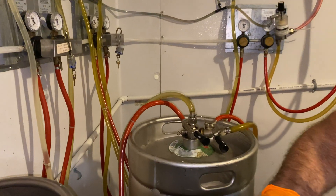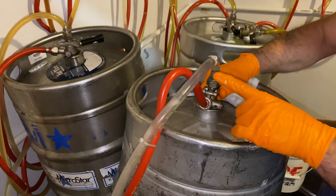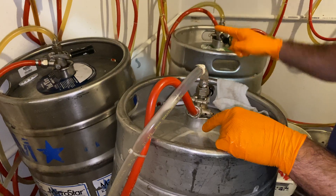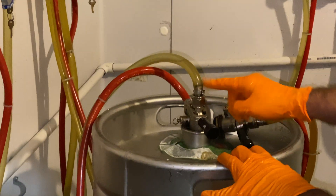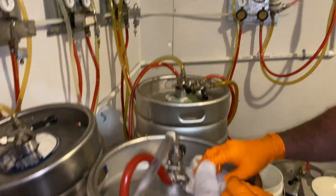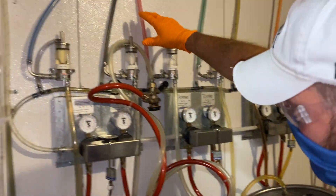Notice the air gap in the line when reattached. If it stays in place, no liquid is flowing — this is what you want. If the air gap begins to move or travel, you may have left a faucet lever in the open position or teeth were not properly seated between the shank and the faucet. Immediately disengage the keg coupler and remedy the issue.